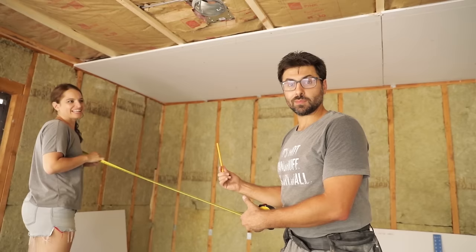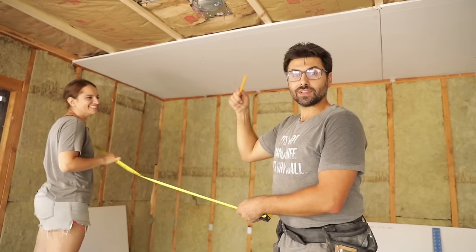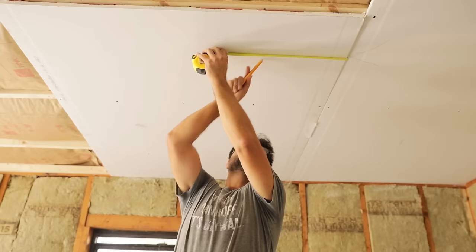So when you mud up the walls or you put your drywall compound on there, you want your butt joints to not be lined up. You want them to be staggered. So we're gonna go a little bit shorter on this next piece of drywall right here. So I'm gonna break. Butt joint. Let's mark out this light. 12 inches, so that's on point.